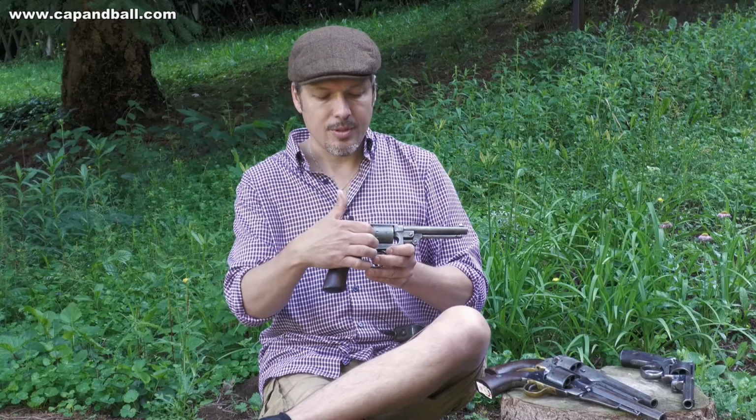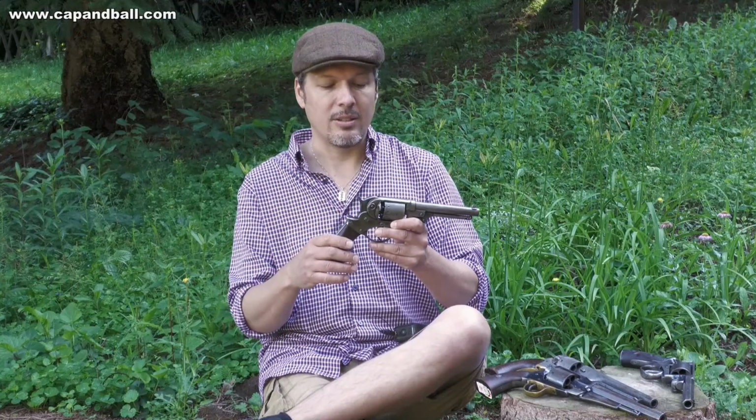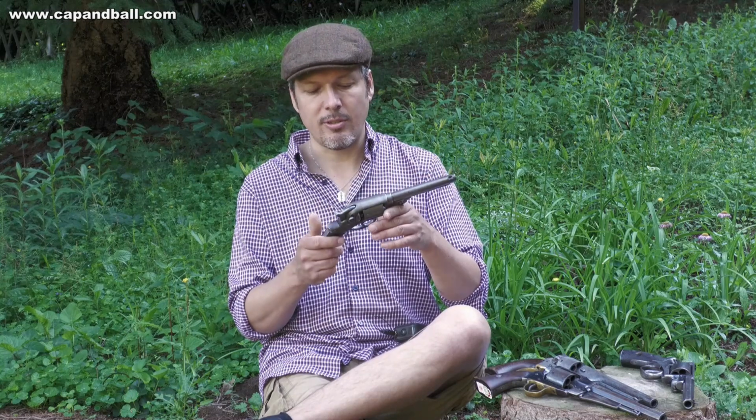This technically meant that these revolvers were fed with the same cartridges as the Colts and the Remingtons, so probably this is why they were so inaccurate. Also, if you check the back of the cylinder, you see that there are no fire shields between the nipples, which means that the spark of one nipple can enter the flash hole of the other one if the cap falls off. So probably this was also a reason why so many chain fires occurred with these revolvers.